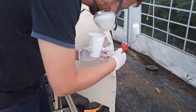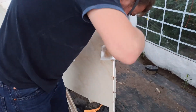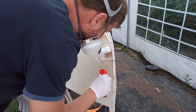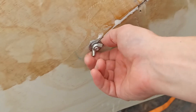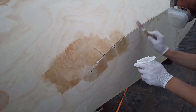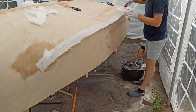To prevent the adhesive joints from tearing apart after loosening the wires, fiberglass patches were glued to the center and frontal areas of the side joints, and also around screw holes to cover superficial cracks from previous bending tests. Once everything had hardened, I removed the wires and the screw, then filled the remaining areas. After curing, everything was sanded and additional side tape was laminated.